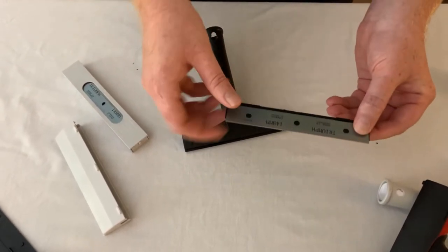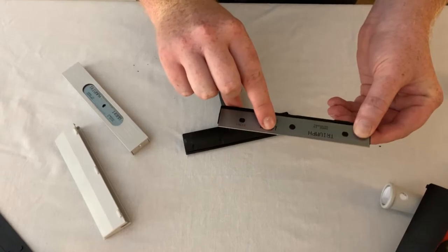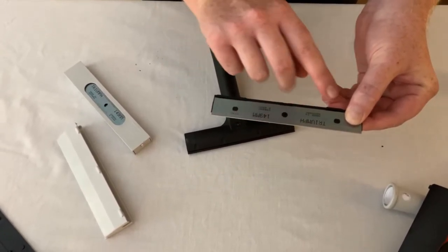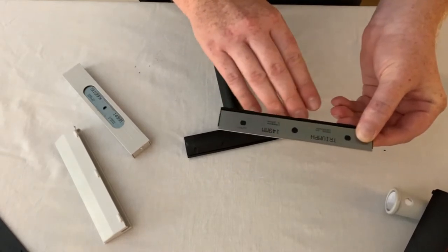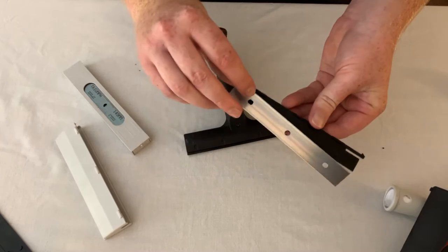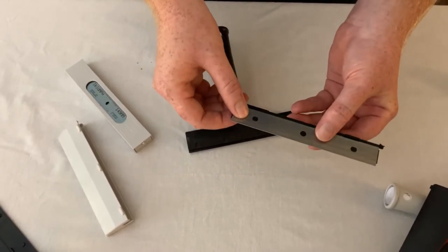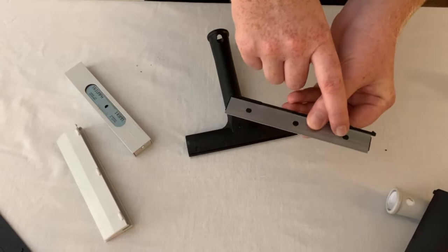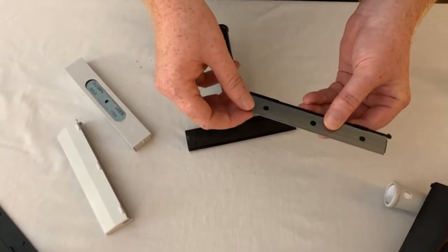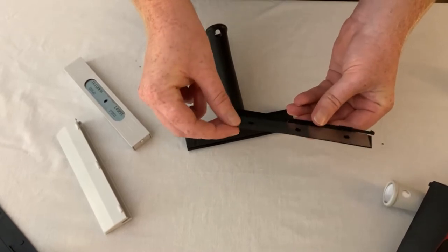The side that was out is probably going to be used up, and if the side on the inside looks new and doesn't look like it's been damaged or rusted or anything like that, we can actually just flip it over and put it right back into those locking holes and use this side. Most of the time, or if it looks like it's got rust or damage, we're going to have to remove the blade entirely and put a brand new one in.